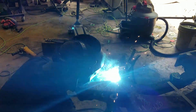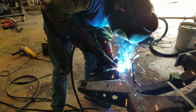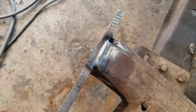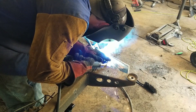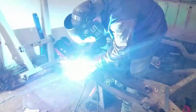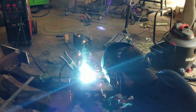We feel good about the machine settings, so it is time to weld these plates for good. The tricky part about this frame is that the outside C-channel is all one thickness — a pretty standard eighth-inch steel — but the inside is much, much thinner. So we've got to be really careful going around the inside of the frame so we don't blow a hole through it, but still add enough heat to the half-inch plate.